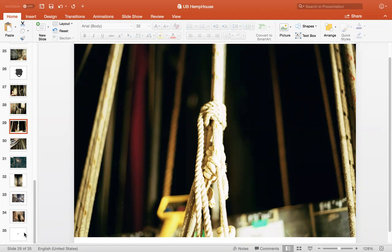So the way it would work is I have a 300-pound carpet that covered much of the stage hanging on this line set. When they wanted to put it on the stage, I would lower it to the floor, raise my sandbag, and tie off the sandbag. They would unclamp the batten from the back of the carpet, lay it out, put some sandbags on the tails, and I could fly them out of the way. And my counterweight sandbag was suspended by itself up in the air.